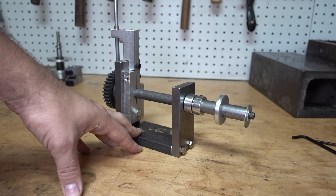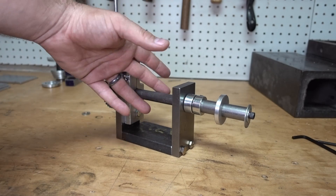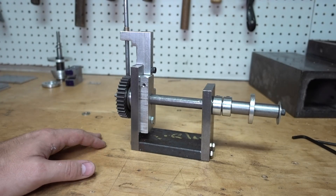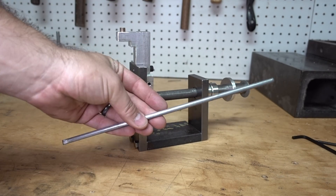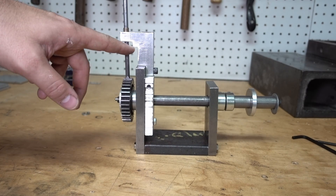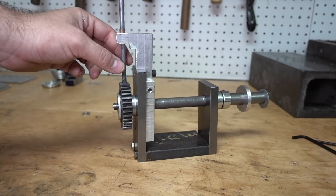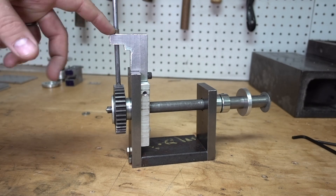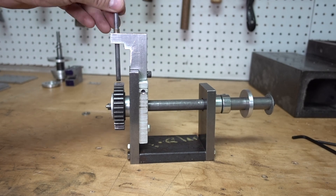The biggest thing for me doing all this — I'm just a home gamer — is the challenge of trying to work with what you've got. Is this thing going to be ultra precision? No. It's a home gamer thing. This piece of quarter inch was way too long but I didn't feel like cutting it down, and that's fed through this piece of scrap aluminum. I pressed in a little bushing because I had it, and because aluminum is going to wear out and create slop.